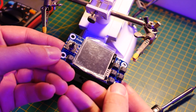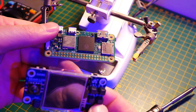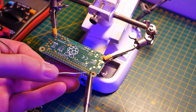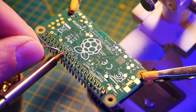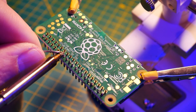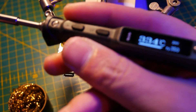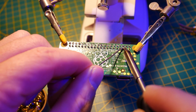I wasn't really sure how to showcase the soldering for you, so I took out a pretty cool hat I have for Raspberry Pi Zero and decided to finally put a header on it. I needed to take out the soldering iron and do the header, and while soldering at 300°C was probably a little bit too cold for that type of joint, I increased to 350°C and had absolutely no problem just zooming through every single pin.